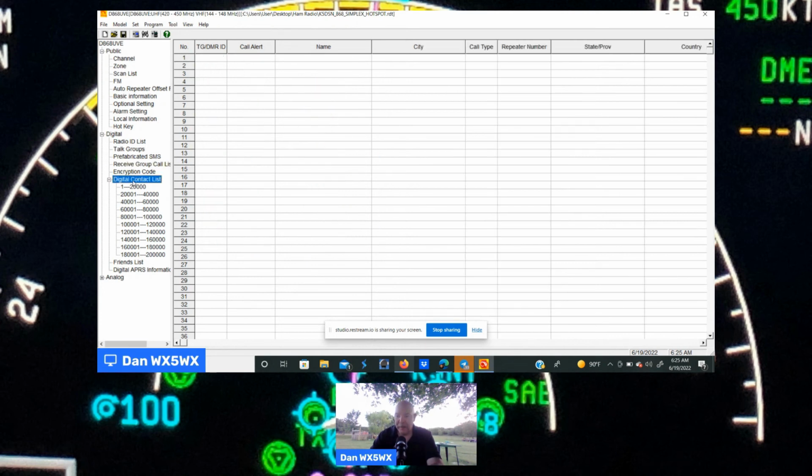All right, so the digital contact list. Now, I'd have to do a whole video on just how to update this. I'm not going to go into it here, but this is important. So they actually publish, I believe daily, there's a website that publishes contact lists. And the contact list is basically going to allow the radio to know the person's ID and name. Okay, remember, people get their DMR IDs every day, right? Like you just did. And my radio won't know you if you just recently got your DMR ID because I haven't updated mine in a while. So you would have to do that.